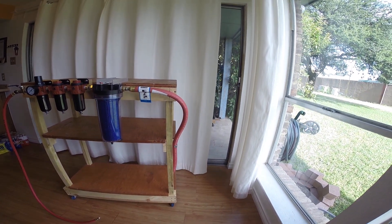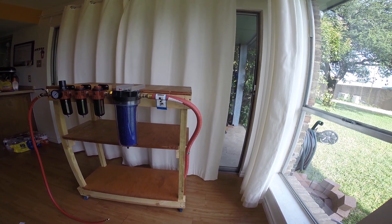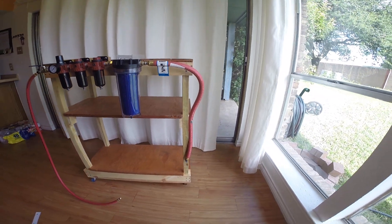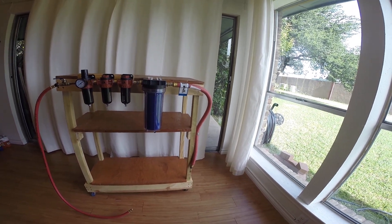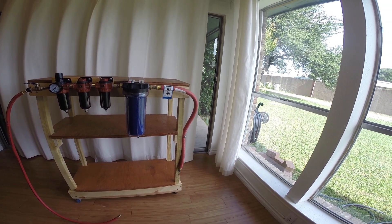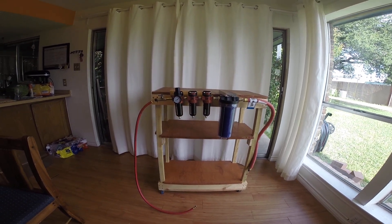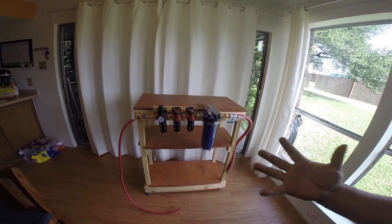This is the DeVilbiss desiccant snake, and it is also filled with desiccant beads. Originally, that's all I was going to use, but when I saw how bad my air quality was as I was sanding, I decided to go for the full system. I will connect to the bottom of this actual air hose — a brand new one that I'll be using for painting, only 25 feet. And at the base of my spray gun I'll have a small inline plastic filter that you can screw in.